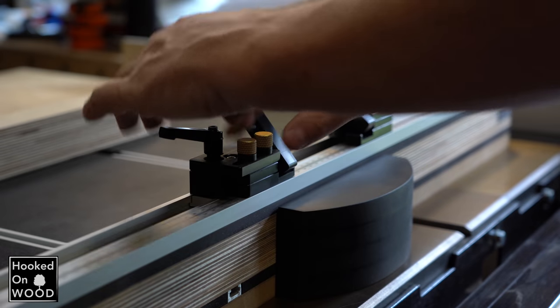I also tested flip stops without needles. I do not prefer one over the other — they all work the same and they all work fine. I tend to like the hand button nut to tighten it, as it is easier to handle. They are very usable on a drill press, and on a crosscut sled I would prefer a flip stop with a needle, but if you do not need that, then they are also suitable.